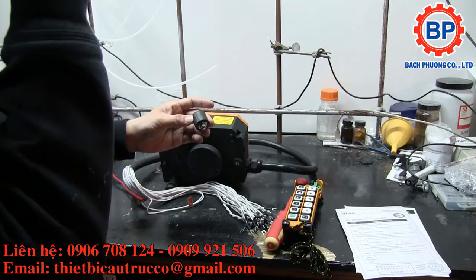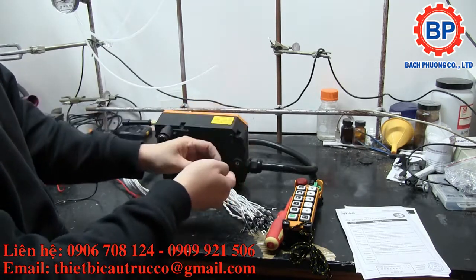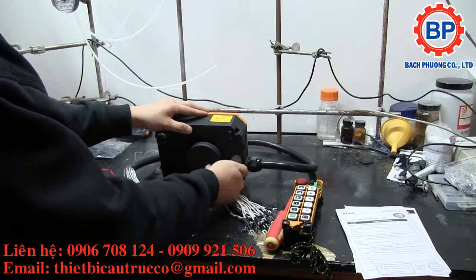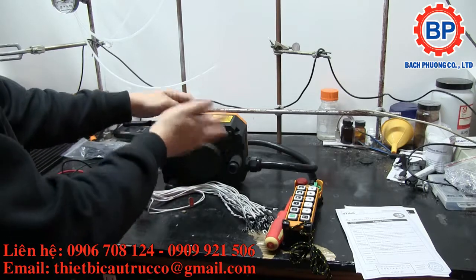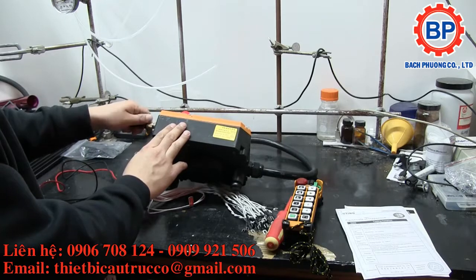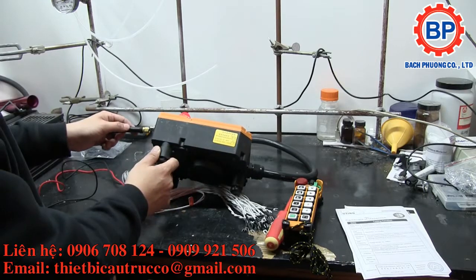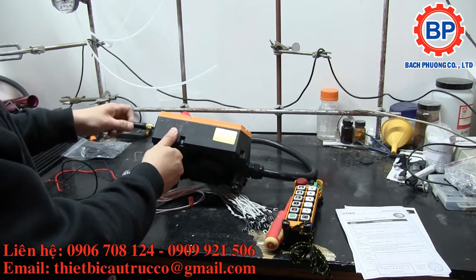It looks like these are M5 or M6 screws probably, because it's coming out of China. So it does come with vibration isolators. It's not too bad, as well as what I presume this cover here is actually to allow the unit to kind of breathe. The RF antenna in this case is actually an old-fashioned F connector, like you would see on your old cable TV. They're cheap, but again, this is VHF, so it's more than capable of handling the signal.